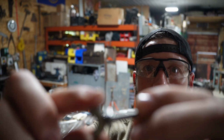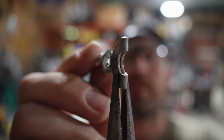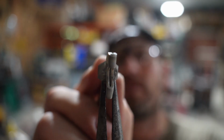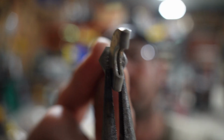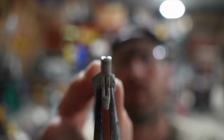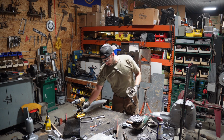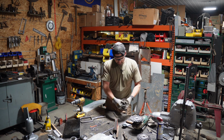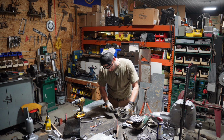And also one other thing to think about, where I'm gonna weld these on. Sure, if I line that up point to point, I'll have a flat open on each side. Whereas if I line it up that way, it'll be points on each side, so if I do need to get a wrench on it for whatever reason, the position of this will be important. All right, so these holes don't have to be perfectly perpendicular just because of the application, but I figure I might as well get them as straight as possible. Can't hurt, right? I really need to make myself a drill block.